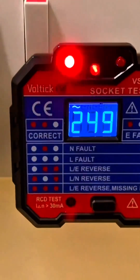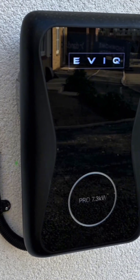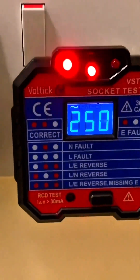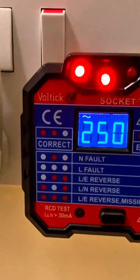So we've got an acceptable value of voltage, but it's slightly high. For investigation purposes that would be really useful — if you had an EV charger that kept tripping off and there were solar PV panels nearby, remember the PEN fault protection also works on voltage. If it starts climbing above 253 volts, it can start causing EV chargers to trip off.